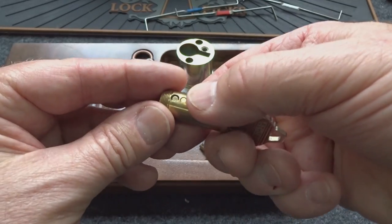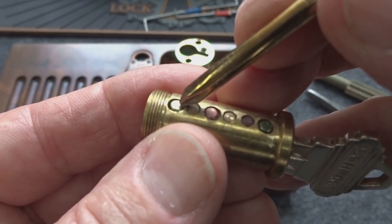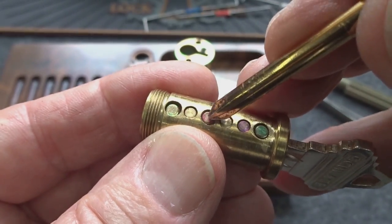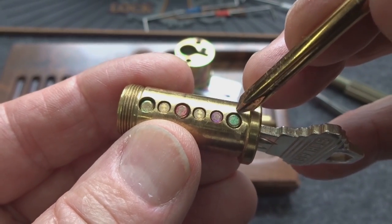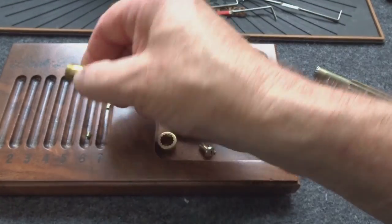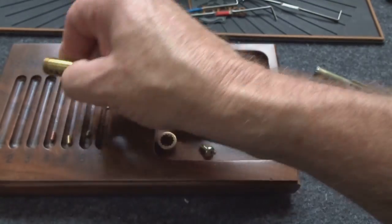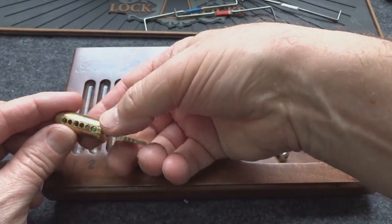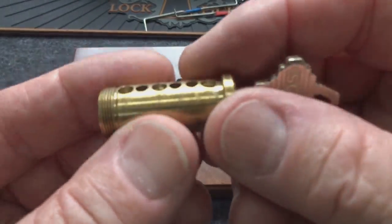We do have a sidebar. Let's pull these pins out of the top before I pull the key out. Starting with number six — you can see number six is kind of floppy, just kind of moving around in there. There's some modification to three, you can see it, and some moderate modification to number one. All the driver pins are standard.